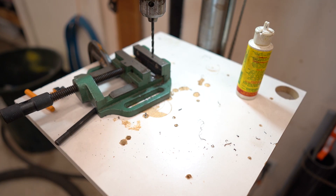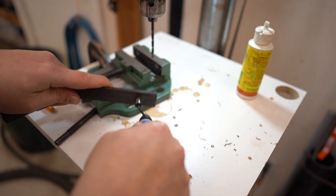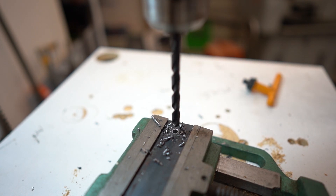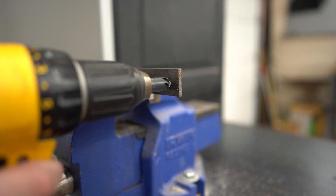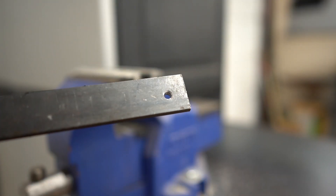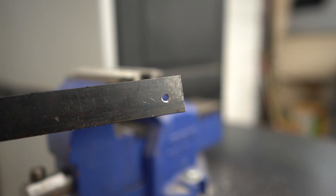There are a bunch of different ways to go about deburring. In this instance I've got a Noga deburring tool — works really well. But if you don't have that, just grab a drill bit a few sizes larger and use it instead. Just touch the face, chamfer the outside of the hole, and clean it up so it's not sharp. My favorite method is using my hand drill with the deburring tool — it works quick, it's uniform, doesn't chatter, leaves a great result. That is how you drill a professional-looking hole in metal: deburred, cleaned up, where you wanted it.